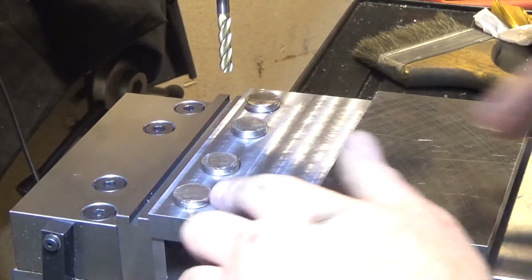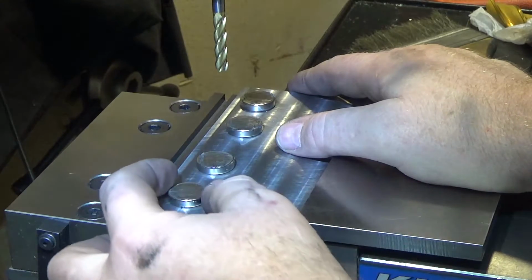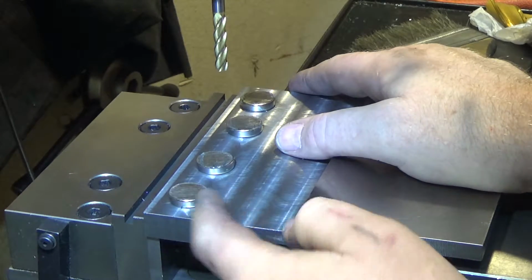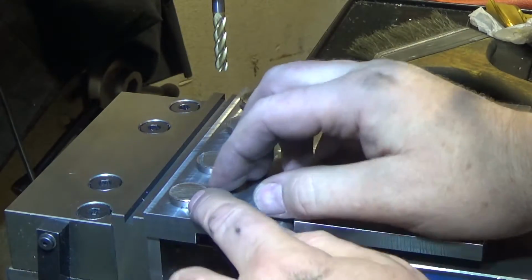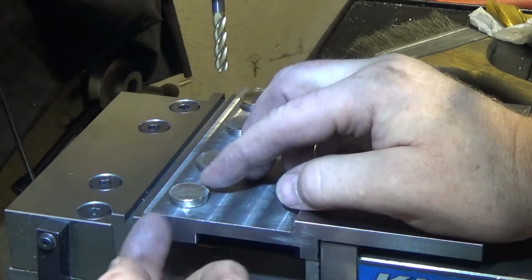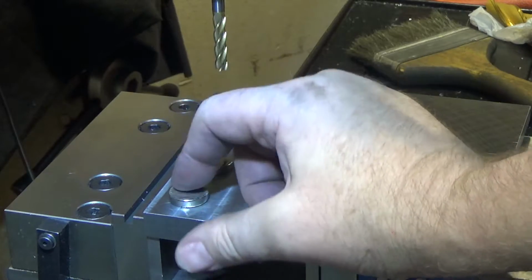Okay, so I've got some magnets here that are just a little bit over 3/4 inch, but it's okay because I'm going to bore out 1-inch holes for them so that I can epoxy them in from the sides. I think that'll work out better. Besides, with a magnet, they create a circuit essentially, and you don't want the edges of the magnet touching a material like steel, because it'll shunt the flux lines right next to the magnet and right back into the sides. What you'd rather have it do is concentrate around the outside edge, so the flux lines are going to come out the top if that's north, and then go back into the steel and then to the back side. So I've got to make sure the bottom of the magnet is touching the back side, because what makes magnets hold better is flux density. The denser the flux, the more they hold. So, if I haven't got that wrong.